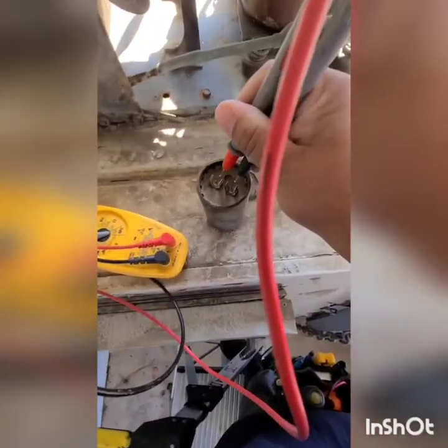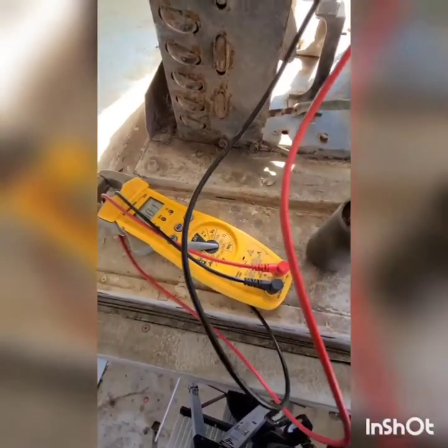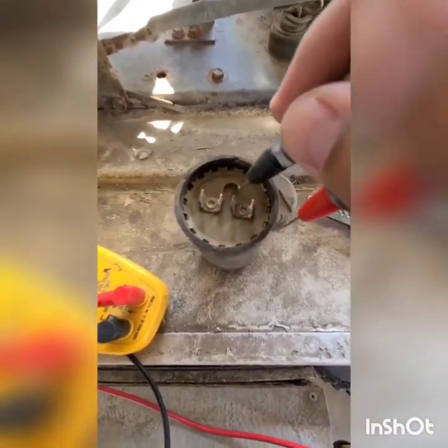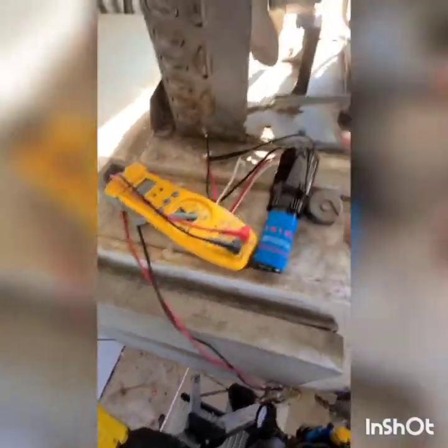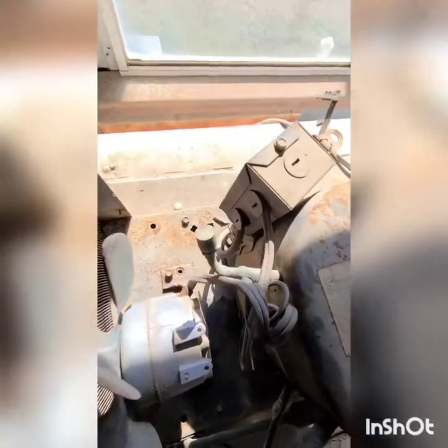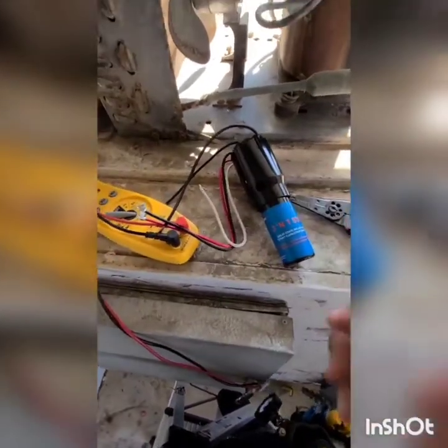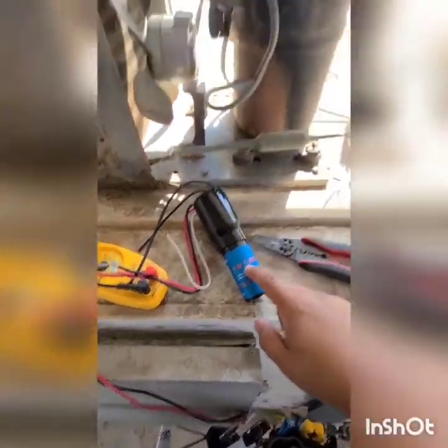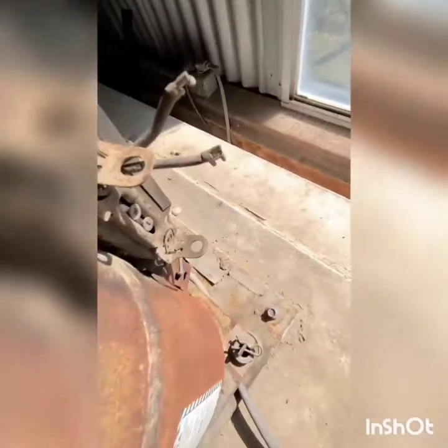This thing's got no juice. I'm going to flip these just to verify — wiggle them around. No juice in there. The safety is still intact so it didn't explode. Nothing obvious but there's no microfarads in there. So what I'm doing is instead of taking out this relay — that OEM relay kit — I'm just going to use the juice out of this one. Keep the relay over there and just plug this into these two terminal wires, those two female spade connectors.